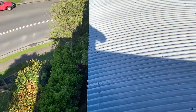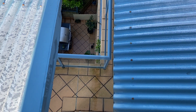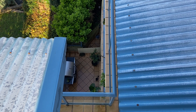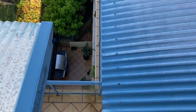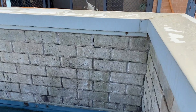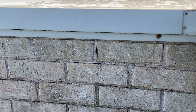Long term, we'd like to see a gutter on this roof to dispose of the stormwater properly instead of cascading in an uncontrolled fashion down to unit 4 and directly below unit 1, which is causing a lot of problems to unit 1's second bedroom and main bedroom. You can see on the parapet wall here, above the second bedroom leaks to unit 6, all the brickwork that needs re-pointing and sealing.